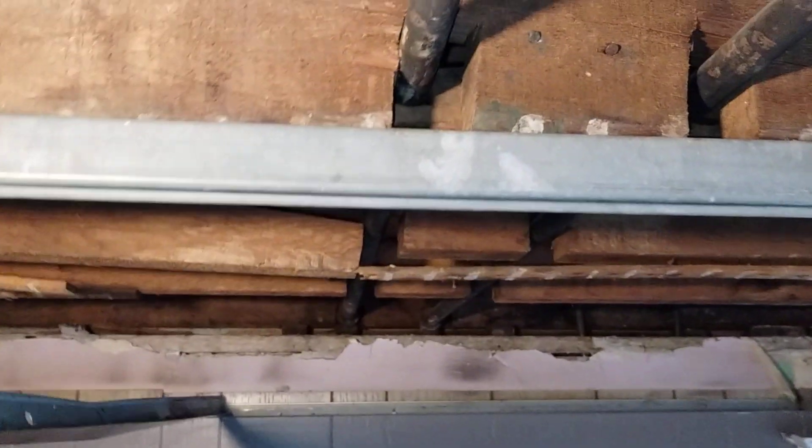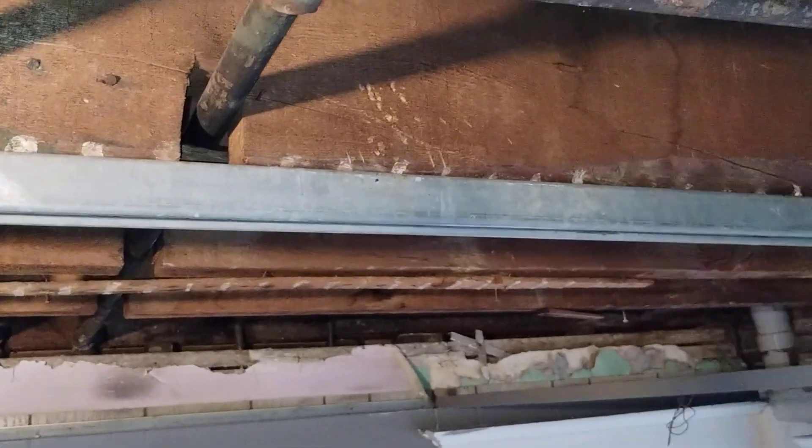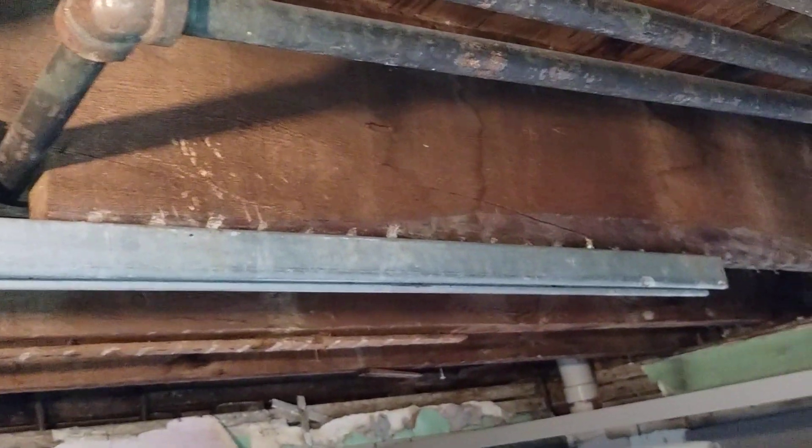This will all be steel and secured here - we're looking at about an 8-inch piece. I like this unistrut; it had holes in it. I was going to make an I-beam to show you what it would look like with a flange, welded up, but I decided to show you how to do it without welding - just drill holes. A lot of you wouldn't want to go to a welder. You could use angle iron, but this will be stronger than a 90-degree angle iron. A box tube could work too but you'd crush it.